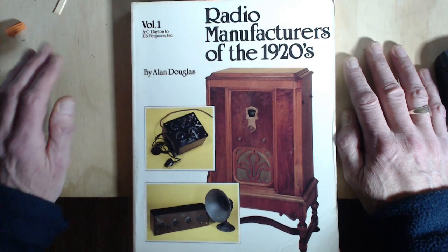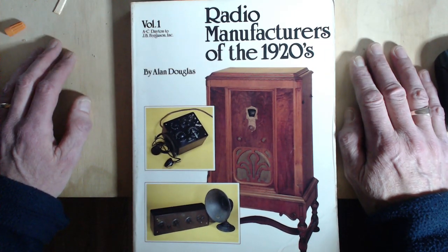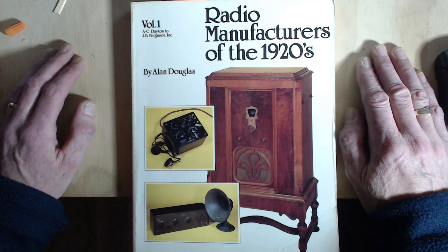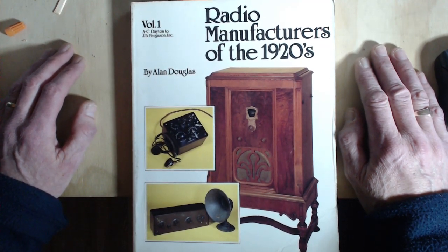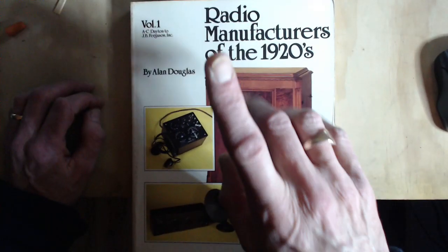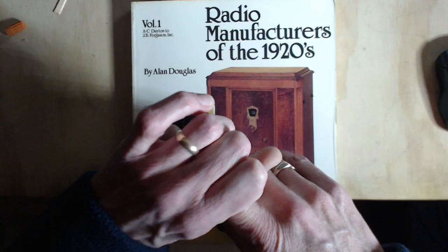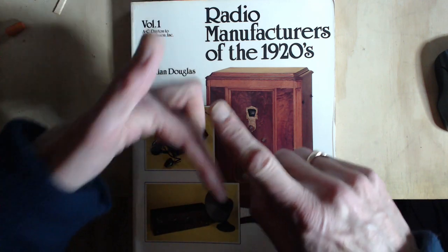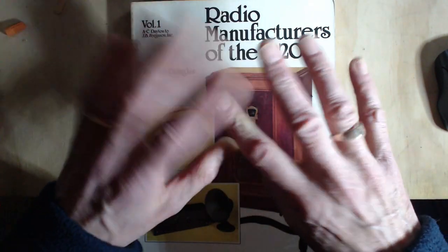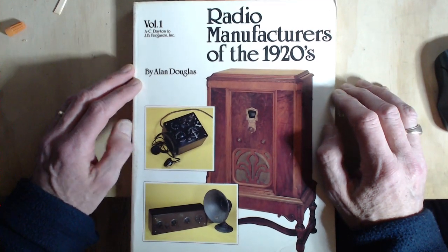You might be wondering once again, what is this, video number 42? How did I get to video number 42 with a lot of cracked wires inside the radio? But in my mind, what I did early on is check those wires for shorts by simply moving them, wiggling them around, all the ones I saw that looked like they could be shorted, including the particular wire going through the hole in the aluminum chassis, which really looks like it should short. The thing to realize is a lot of these wires have the copper conductor and the outside black plastic that you see is cracked, but there's another layer of insulation inside, a cloth cover that's wound around the conductor. So even if the outside insulation is cracked, it doesn't necessarily mean that there's a short circuit.